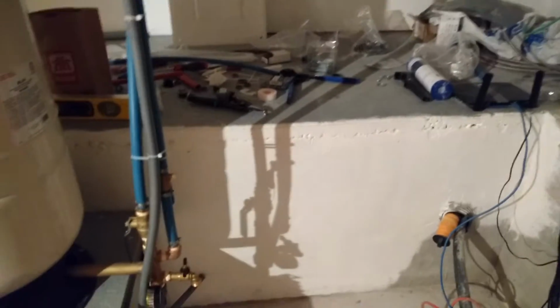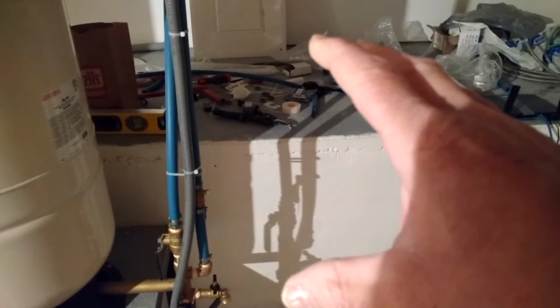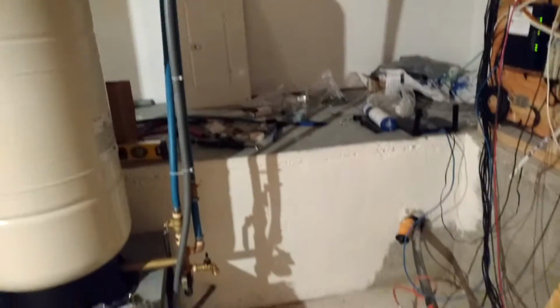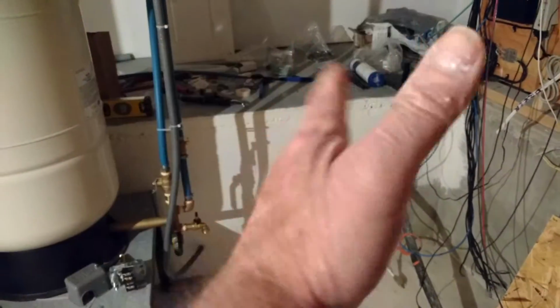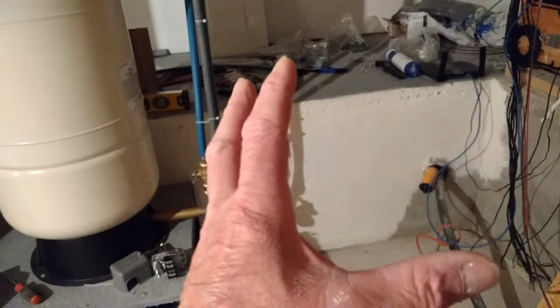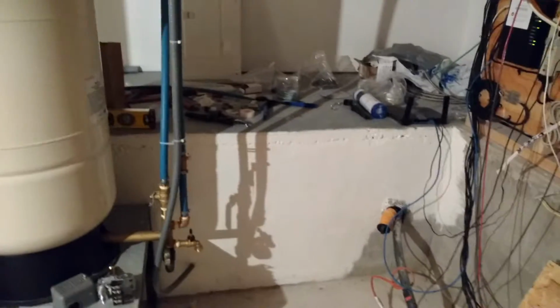So therefore all you have in the actual well is the motor itself, which I kind of like better, in case you have any problems with the electronics. The better 3-wire well pumps also have what they call a soft start, and the 2-wire system as well, but that's the $1,600 one. The one I'm looking at is a 3-inch, so it's a little narrower, so there's a little more room between the walls of the well and the pump. But the 3-wire one I'm looking at is a soft start. It's a 4-inch diameter, but still, being a soft start, I know that my well can easily supply me the volume I need. Once again, that's about $1,000. So having a control box up here is good, because usually it's the electronics that go, not the actual pump motor itself.